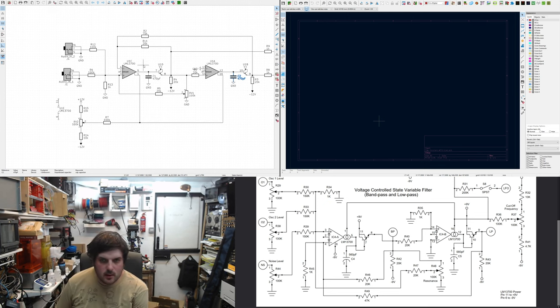Okay, then pin 5 goes through a buffer, 20k to minus 12. There's a capacitor in between the buffer, and then there's 20k between the two stages. So we're cutting it down again. Ah, it's missing the second voltage divider here.